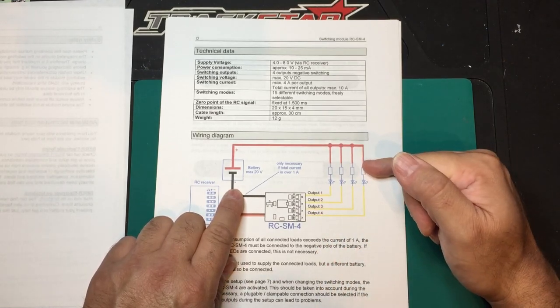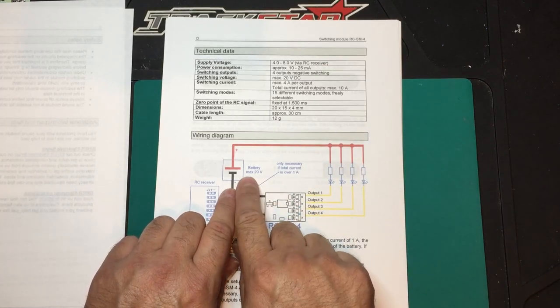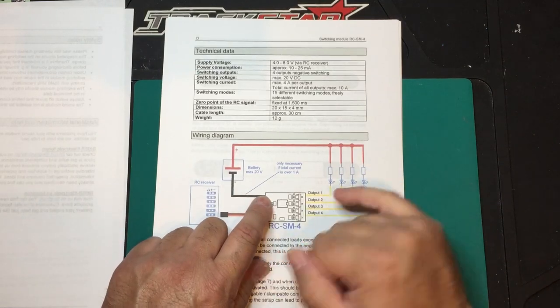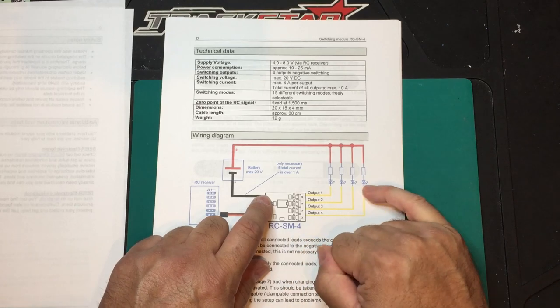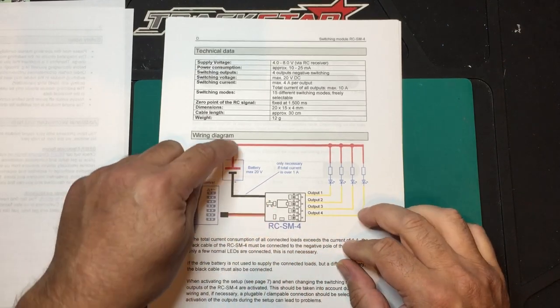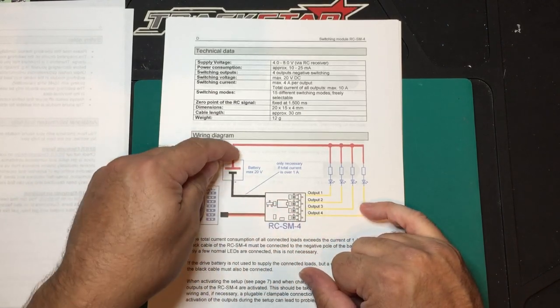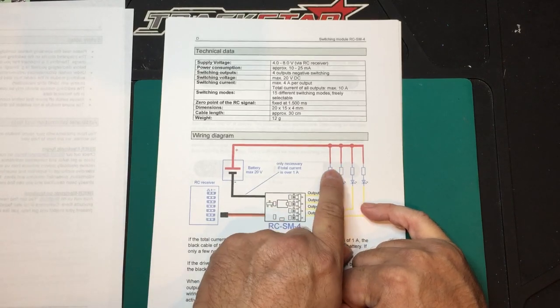And this little box section or rectangle represents the resistor. Depending on what input voltage you supply, say 7.2 volts, it will depend on what size this resistor is and what LED you're running, because some LEDs do have different wattage ratings, therefore they need different resistances. Whatever you put in here negative comes out of the four outputs as negative. Whatever you put in as positive goes to the side of your lights or components, motors or whatever you're switching,